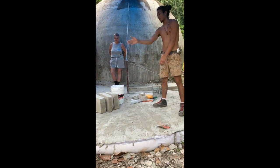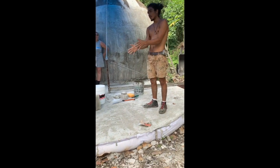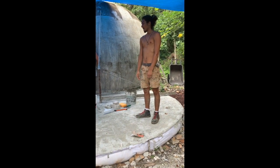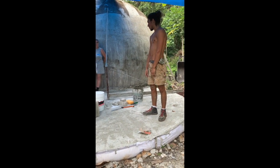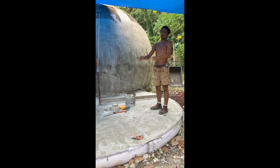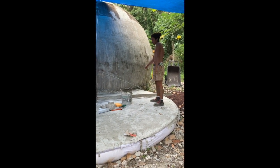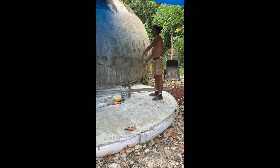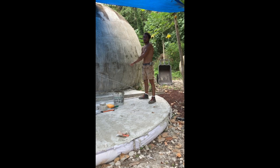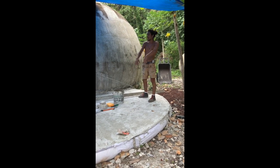Once you have your fabric on the perimeter, the fabric comes straight down and goes in a little ways, so once the aircrete is sitting on top of it, it doesn't let it explode everywhere. Then you just pour aircrete in. I always like to start on one side and work my way around — put the screed all the way over, pour the aircrete, pull the screed a little bit, pour more aircrete, pull the screed a little bit more. That board is called a screed — once I pour and screed, I never have to touch it again.